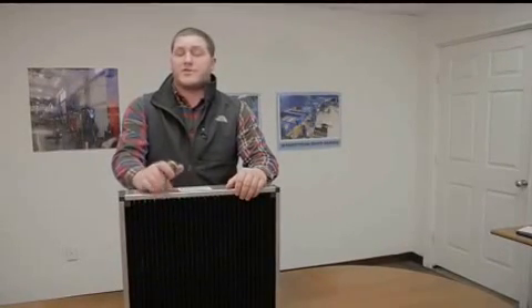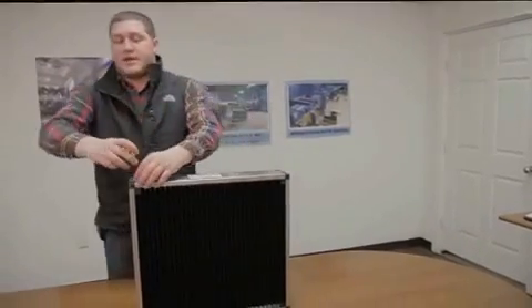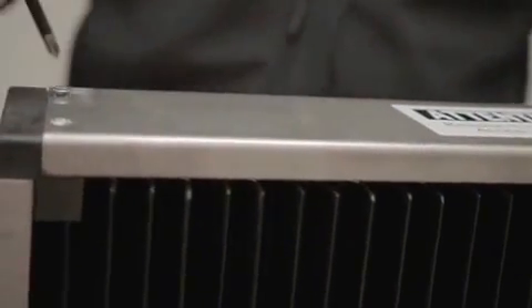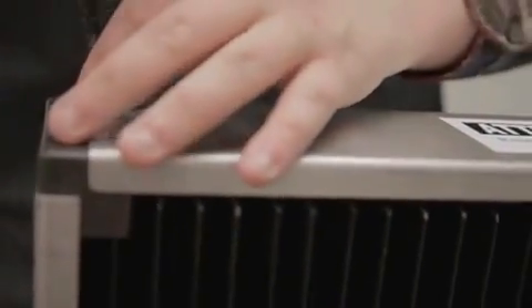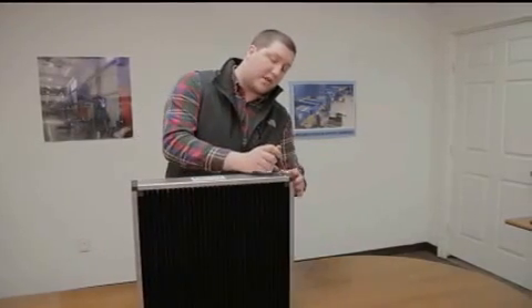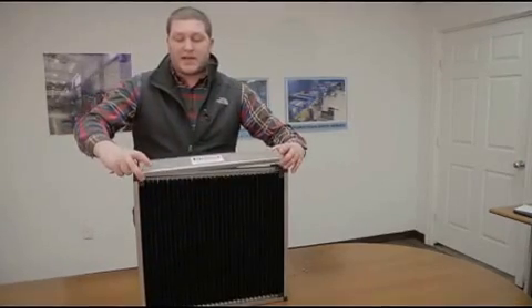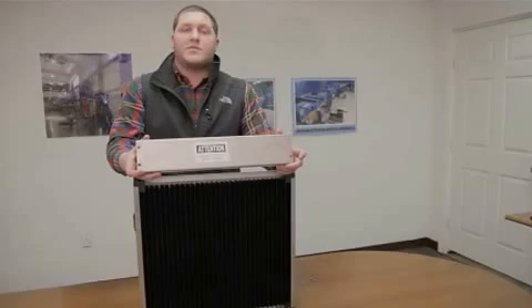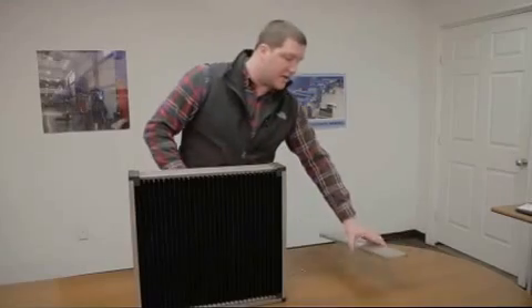Filter One is now going to show you exactly how to take apart your brand new cleanable impingers. On the top and bottom, you will have four screws in each corner that a simple Phillips head screwdriver will take. All you need to do is take each one of these out, but make sure that you are taking out the correct sides of your cleanable impinger. As you can see, our pleated filter mechanism — our chevron design — is going to be running perpendicular to the top and the bottom. We've also labeled stickers on each cleanable impinger so that you are able to do this easier and safer.